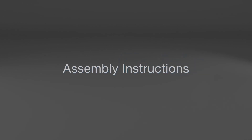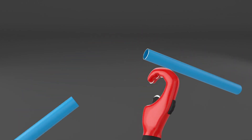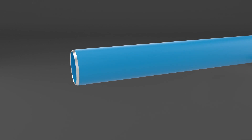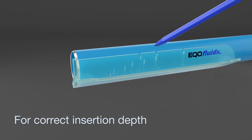A few simple steps ensure correct assembly of pipe fittings. If you need to shorten the pipe after cutting, remember to use the internal chamfer to avoid leaving scraps, and the external chamfer to avoid cutting the gasket of fittings. Make sure to mark the pipe so you will know when it is completely inserted into the fitting.